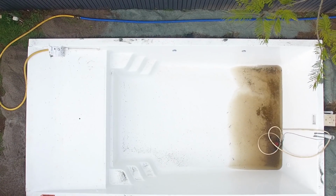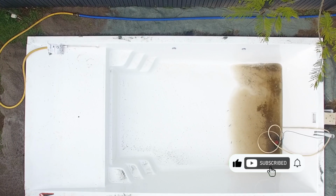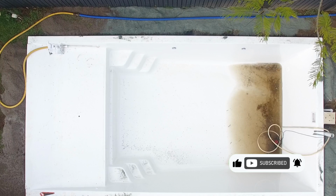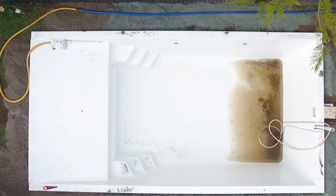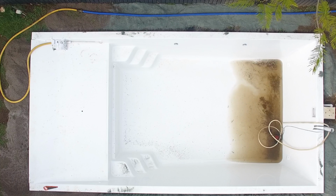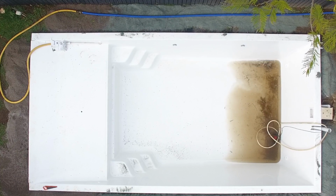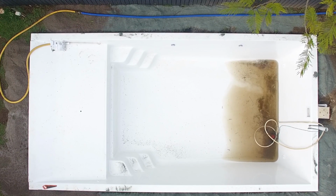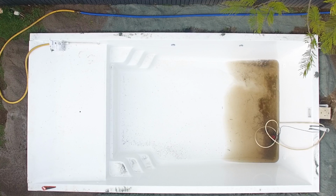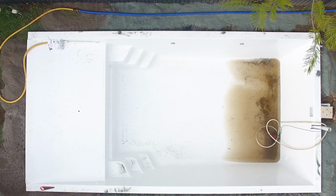Otherwise, the water cart is going to want to dump all of the water into the pool and then leave as quickly as possible. And that's going to make life really difficult for you, because the leveling part of the pool, getting all of the corners set at the right level that you want the pool to finish at, is done in this first initial stage, in this first 300 mil of depth of water in the pool. So don't cut corners by saving $50 or $100 on the water cart.